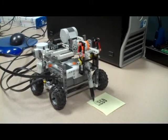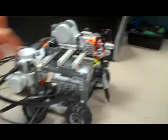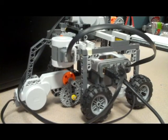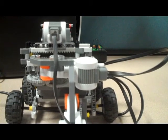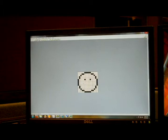I built this nifty little printer, which moves around a felt-tipped pen to write on paper. It uses three Mindstorm motors to control the motion in each direction. One motor moves the printer forwards and backwards, another motor moves the printer head from side to side, and the third motor raises and lowers the pen onto the paper. It prints out the picture by drawing one dot at a time. I made this LabVIEW program, which makes it easy to draw the picture.